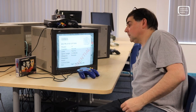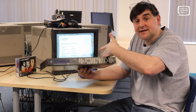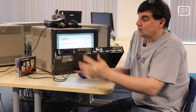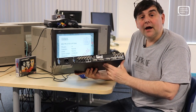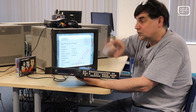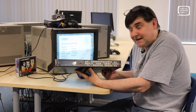Let's have a look at one of the bits of equipment we've used. This is a TV1 scaler — it's a dual independent scaler, so there are actually two units in this one box. We're able to feed our video signal into this unit: channel one takes a video feed and channel two takes the same video feed — that's unscaled, the full screen. Then we can take an output from it to each of the other two screens, which will be scaled. We can use the control panel on the front to say on scale A zoom into the top left, and on scale B zoom into the top right. These were about £8,000 to buy back in the day — really expensive bits of kit, but they do it extremely well.